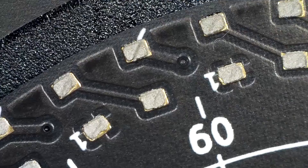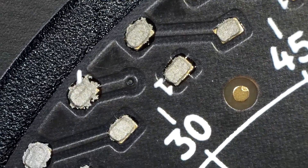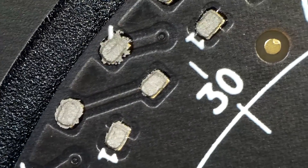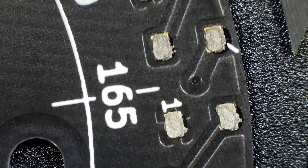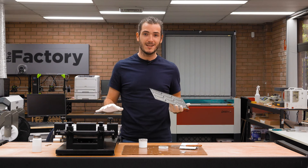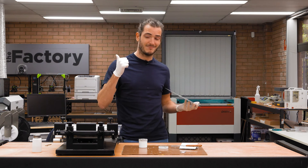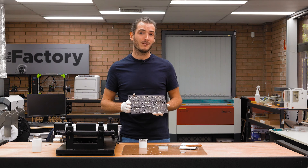There are a few pads that are looking a little lopsided — that may have been from a final pass with the squeegee pulling the solder to the side a bit. You can see a bit of what I'd call underspray. I don't think that's a problem for most components because that solder should pull together. But definitely a little consistency to work on. Otherwise, pretty happy with these results — this is a great board for learning how to stencil because these are very forgiving components. Obviously this workflow evolved around this particular machine but I'm sure it's transferable to other manual machines as well. If you're a solder stenciling aficionado, I'd love to hear your thoughts or any comments about squeegee angle, pressure, or your favorite solder paste. The best place for technical discussion is in our forums. Thanks for watching.